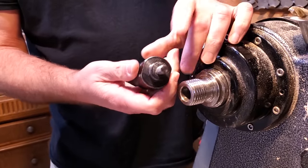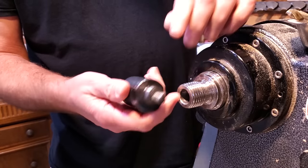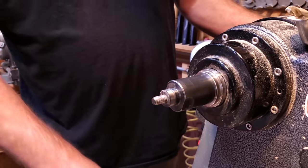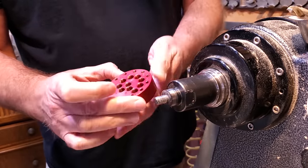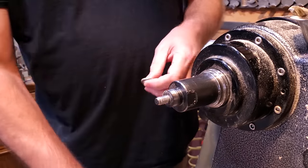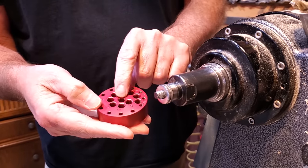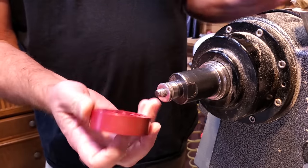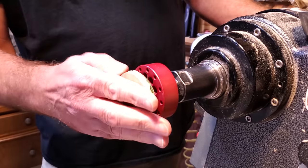This is the mandrel for the jig. It's identical to the bottle stopper mandrel, except it doesn't have the flute cut in it for doing threads. We're going to thread that on — just like that. This is the offset plate that we're going to use to make the pendant. It's numbered on the back side. To start the pendant, when you get the jig, it comes with these two washers. You want to put those on first because we're going to use the center hole to put the pendant template on. You need to offset those washers so that when you screw this on, it actually goes all the way down.